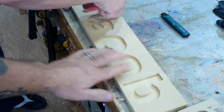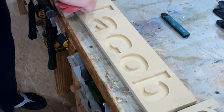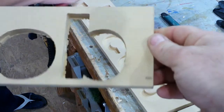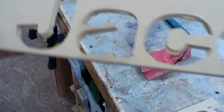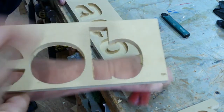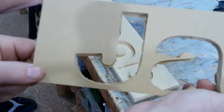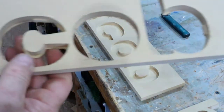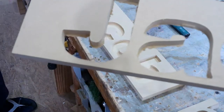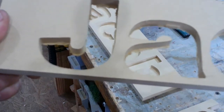Now, looking at this, you'll notice this is not the right one — let me grab the coat rack. Here it is. You'll see it has no holes for the pegs; I made a mistake in the programming. Lisa pointed that out, but where there's a will there's a way. She gets the pegs off Amazon. We can take a drill bit and drill a hole for each peg — just because you forgot to put them in the program doesn't mean you can't add them later. Typically you would program a pocket cut at stock bottom with the diameter of the peg. I'll take you over to the drill press and show you.